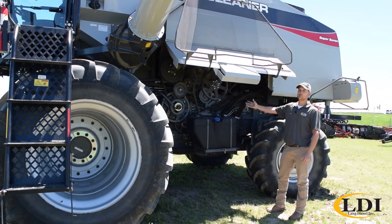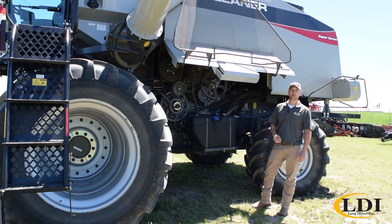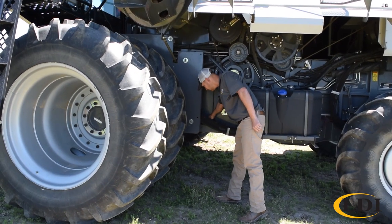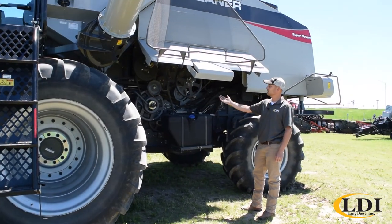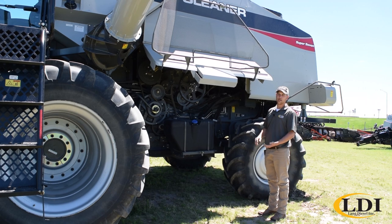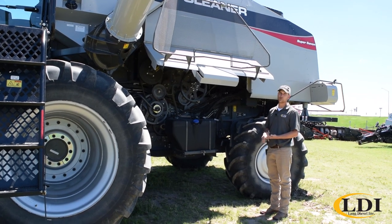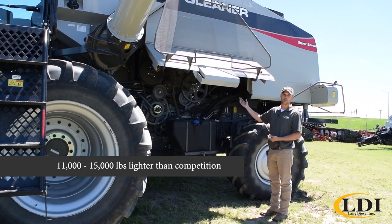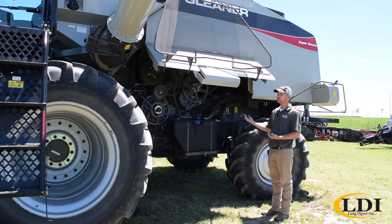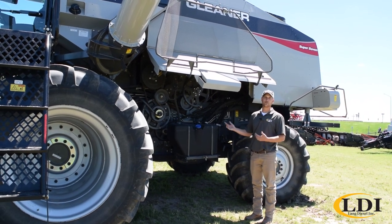The other great advantage we have is the simplicity of the machine. We run simple straight-through drives that are easy to service and maintain, whether in our shop or on your farm, and it can be done very cost effectively. You can reach most things around the machine from ground level with very good access. Through that access panel you can actually stand up in the belly of the machine to service components such as the transmission and the cleaning fan. We don't drive a lot hydraulically — hydraulics consume a lot of horsepower, with about 30% of your horsepower used generating heat, which reduces fuel efficiency drastically. We have only one gearbox on the entire machine for our rotor, and you lose one percent horsepower through each gear set, plus those are expensive items to maintain as the machine gets hours on it.